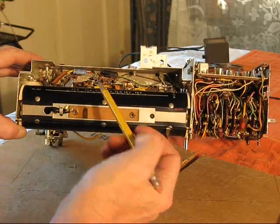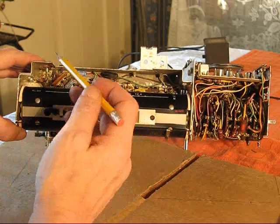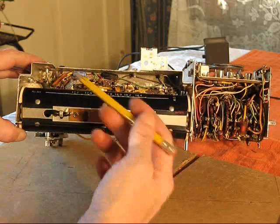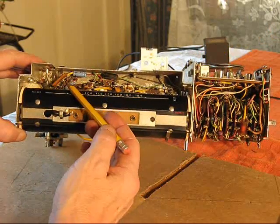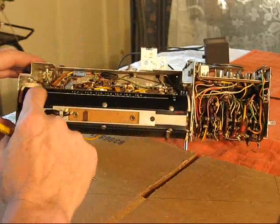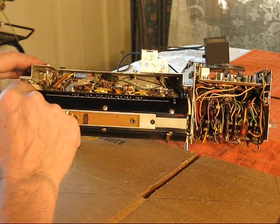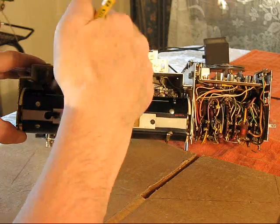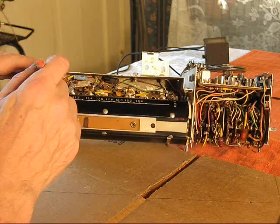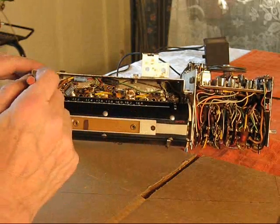So it may have been nothing more than a cost reduction, or a combination of cost reduction and reliability in terms of temperatures. I don't know. You can look it up. I probably will later. Anyway, the Z-Pack is in the way of getting down to the terminal I need to solder to, or at least the wire. It's very short, like the wire on the bottom of this electrolytic cap. So I need to get in there.